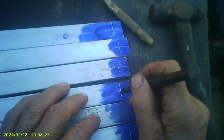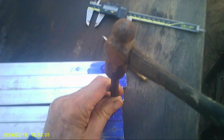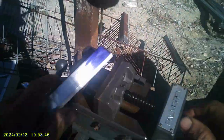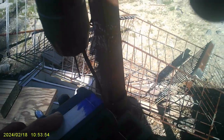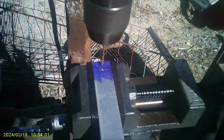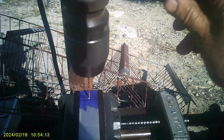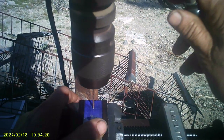This is sharpened too, so find the little sharp hole and make it just a little bit bigger, and then the 16th-inch drill should find this. Because I don't have a mill, so I won't have to locate these precisely. I'm just going to put it in here, get it approximately right, use the vise to dial it in, and hopefully the drill will sink in there centered, and then I can just drill it.